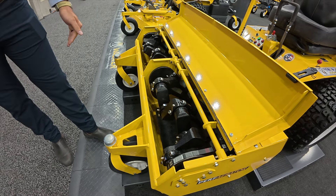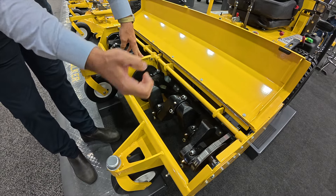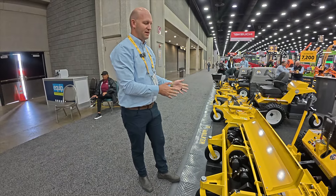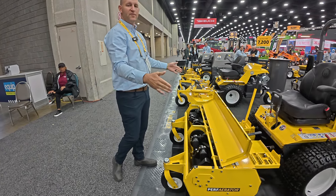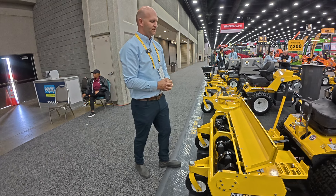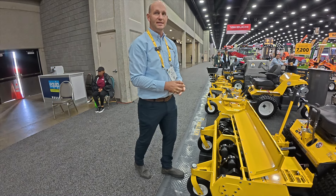The tine bearings are individually replaceable and very easily removable. If you need to replace or break a tine, two bolts remove the tine cap and it'll drop out very simply — maintenance and repair is much easier than the prior version. The overall aeration width is 42 inches from tine to tine, with 12 tines total — six per side — giving a nice aeration density.